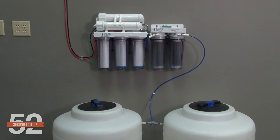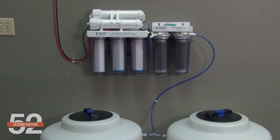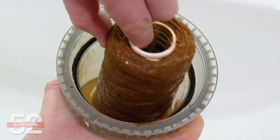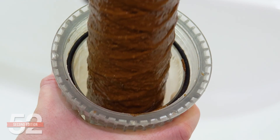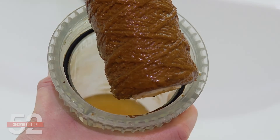When considering the right flow rate for your tank, consider these two things. When do you want to turn on the system for your water change? A 75 gallon per day unit is about three gallons an hour; 150 gallons per day is about six gallons an hour. But remember that flow rate is also tied to pressure — a booster pump in our test showed you could get 200 or more gallons per day from dual 75 gallon per day membranes with even better rejection rates and lower DI resin consumption. Believe it or not, the next most impactful filter on an RODI system is the cheapest — a sediment filter — and it can be tuned to your system as well.